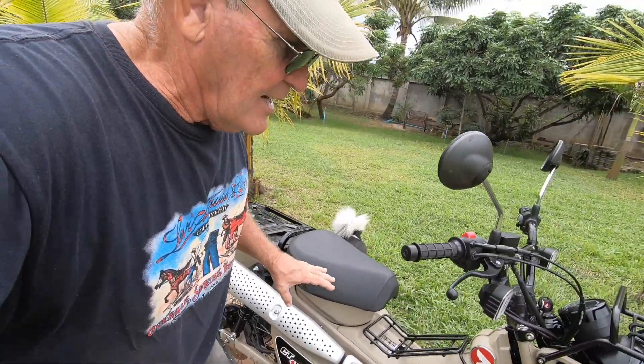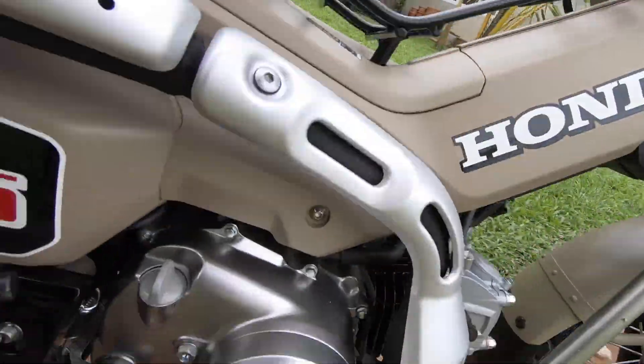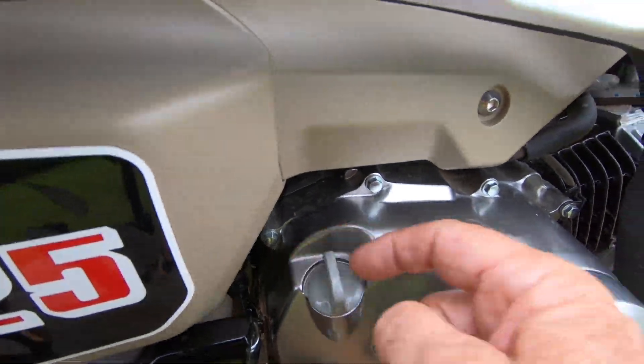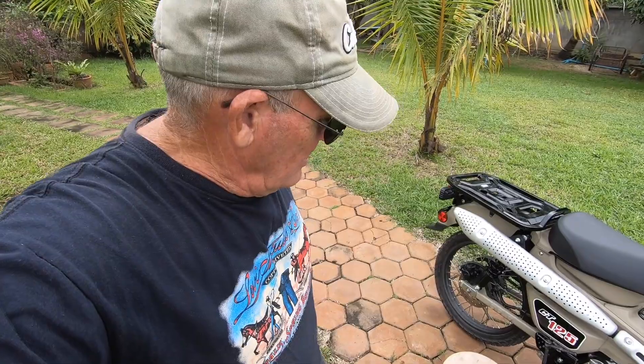When you're doing the wash job and cleaning things up, you'll notice if something's wrong with the machine. I had checked the o-rings on the oil fill tube, and what I found was the cap was angled. What it did was cause a little engine blow-by — when the engine pressures up it'll blow a little oil out anywhere that's not sealed up good. I took it apart, cleaned out the o-ring, there was a little bit of dirt in there, and put it back together.